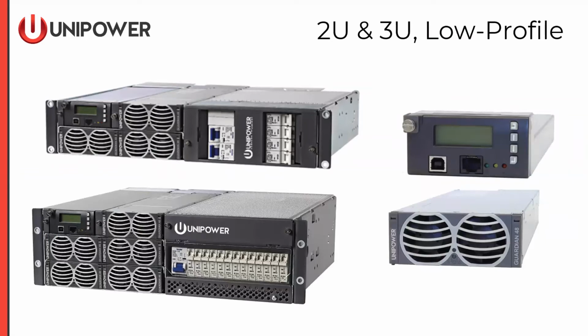The systems that we're talking about specifically today are the Guardian 2U and the Guardian 3U systems. On the top left, you'll see the 2U system comprised of 3 rectifiers and some battery and distribution. The 3U system has 5 rectifiers and obviously a little bit more in the way of DC loads. They both use the same controller, regardless of the system that you select. It uses what we call the ACX controller, and there's a picture of that on the upper right-hand side of the screen. And we use a variety of rectifiers based on size, and the Guardian rectifier picture is in the lower right-hand side of the screen.